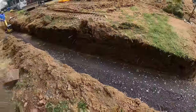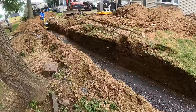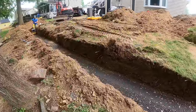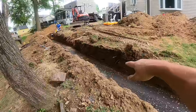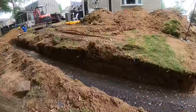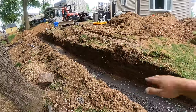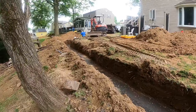And this wall is also going to have a geogrid reinforcement. We're going to put two layers in. It's only a 3 foot high wall. Usually you don't need it for that small of a wall, but with this being a hillside like this, I build them that way, so I know it's going to last. After we get our first two rows in, I'll end up cutting back this grass a little bit. And we're only using 3 foot geogrid. A foot of it's basically under the wall or sandwiched in between the blocks. And then you got about 2 foot back. Got more to come.